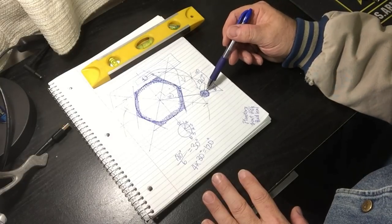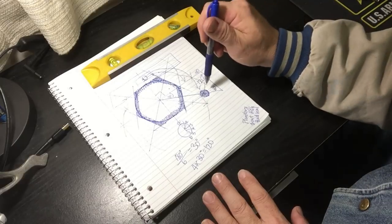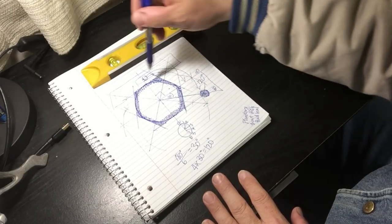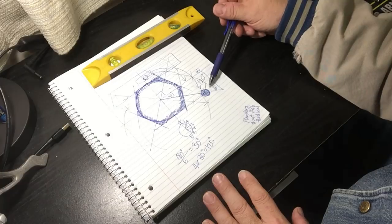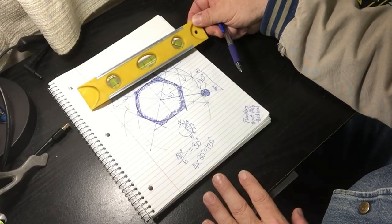In order to fill the planetary front hub, check the fluid level and or fill it, and put it at the 4 o'clock position, put a level on that upper part of the face of the bolt, and it should be perfectly aligned at 4 o'clock when the level is at zero bubble.